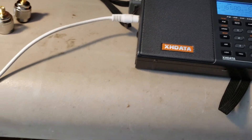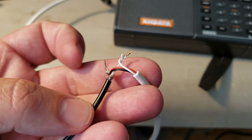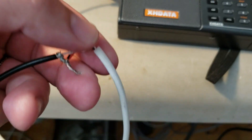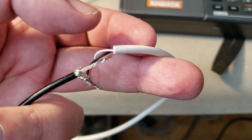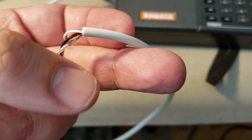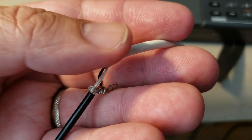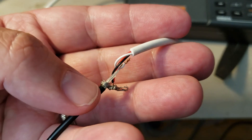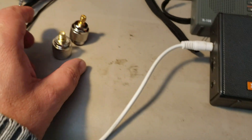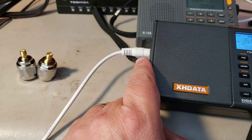I haven't yet completed the cable — this is where I spliced it. We'll be adding shielding around it, maybe some aluminum foil, making sure nothing touches, and then soldering the wires together and probably using some heat shrink to complete it so it looks nice. I've got the adapters here, so I don't know if anybody found an official adapter that fits and lets you just plug in the SMA cable.